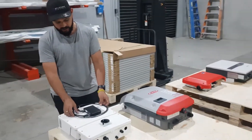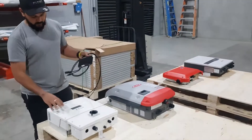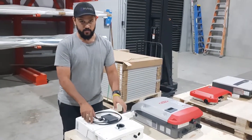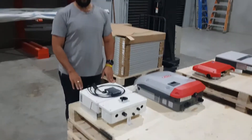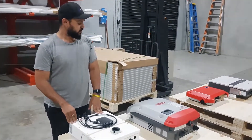And lastly, SolarEdge, which works with the little DC optimisers. SolarEdge says it's all good for 6.7 kilowatts worth of solar, but we've got to keep it to 6.6 kilowatts to stay within the rules and the 33% limit.